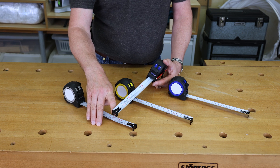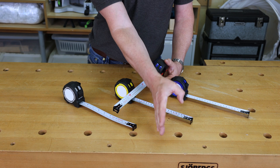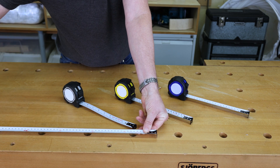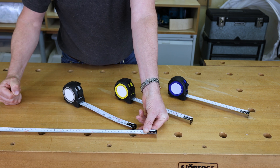The slot means that if you're doing longer work, you can bang a nail into the centre of the joist you're working on, clip the tape onto that nail, pull the tape measure out a long way, and then mark out the centres for all your other joists.